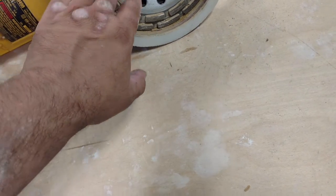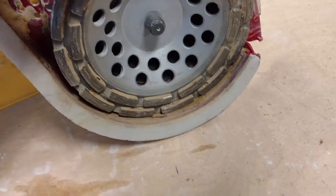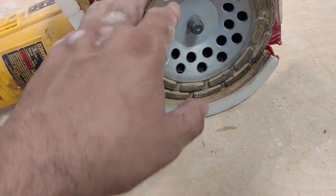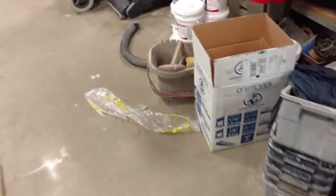One of the things that we use this for — you can see it's got wood on it — is we use this to denail and destaple. So when you're tearing out other underlayments, you just go over this. One of the things you want with this particular one is you want to use these kinds of rings and not turbo rings. I'm going to walk over here and find what I did with one of my other shrouds.